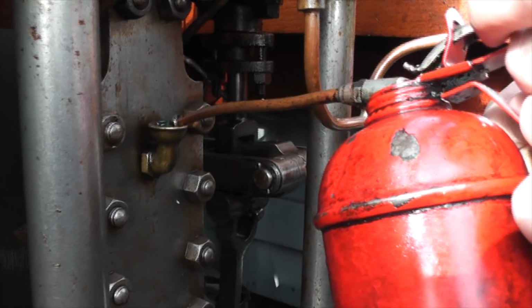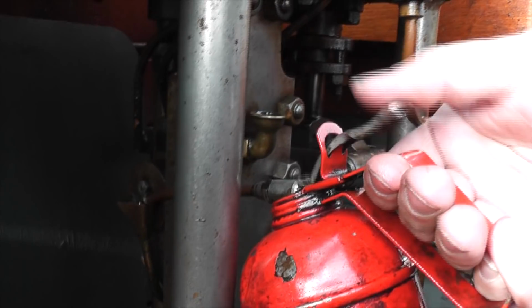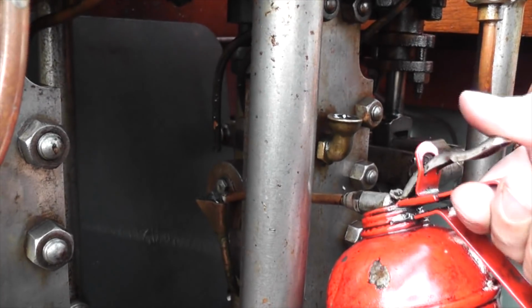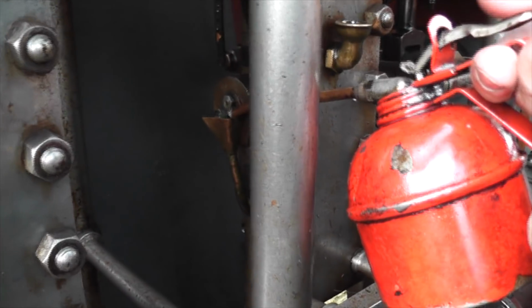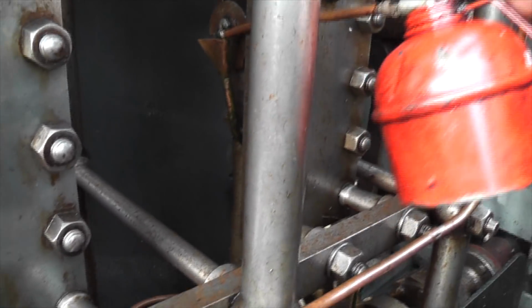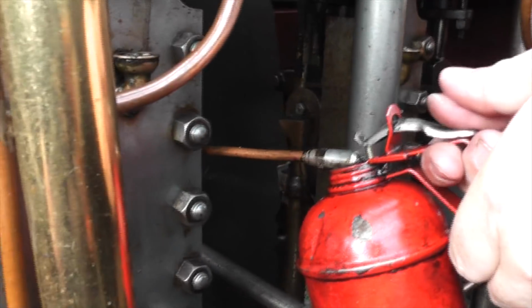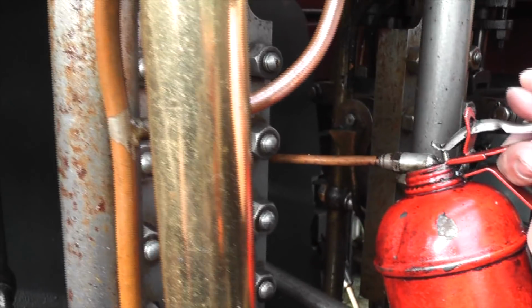2 little squirts into the back. It goes down on the slide, and that's the oil cup that goes down to the big end. That can fill up all the way down to the bottom. You will see it better on this one here, actually. And if you work your way up the engine methodically, you get into the routine and you won't miss anything.